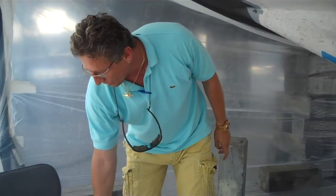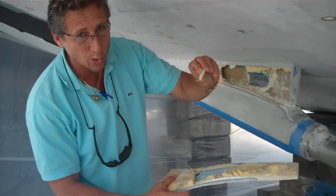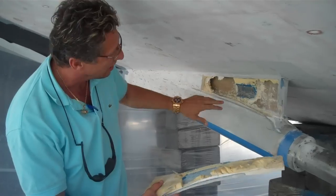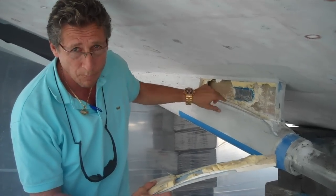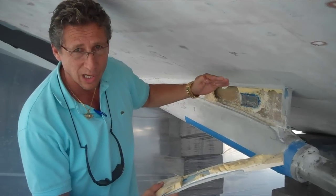Here's a perfect example of what it is. You'll see somebody took some foam with hot glue and just glued it in — it's not even attached; I can get my finger back here. This should be a structural foam, vacuum bagged in, laminated with staggered layers into the hull and epoxy.